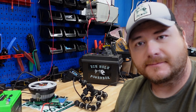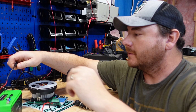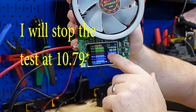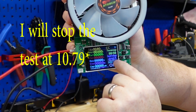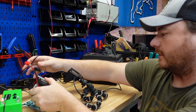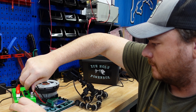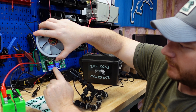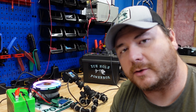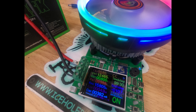The charger is green, indicating we are fully charged. I'm going to disconnect it. Our settings: discharge at 0.8 amps, cutoff voltage at 10.7 volts. The battery is reading 12.69 volts — fully charged. This will probably be a pretty long test. I'll check back in when it's done.